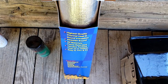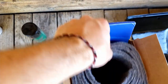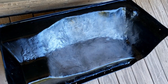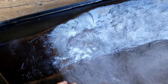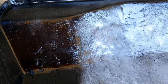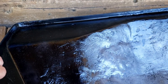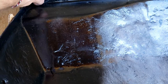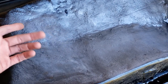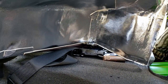I'm going to put in the thermal barrier on the inside of the doghouse cover. I got this — it's called a Thermal Guard — and it's rated up to radiant heat of 2000 degrees. It has a shiny side and an insulation side; we're going to stick the insulation side on the inside of the doghouse cover with the shiny side out. Once I do that I'll come back over it with another thin stick-on shiny insulation that's also good to over 2000 degrees. We'll put that first layer on and then the second layer, which will allow us to get all the way up to the edge more easily since the first stuff is a little thicker.